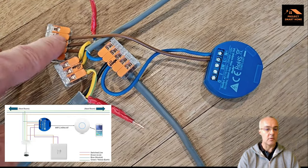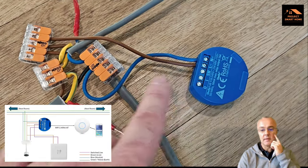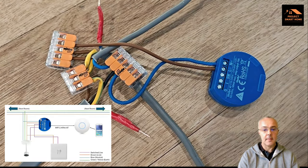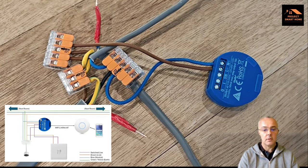As we saw from the wiring diagram earlier, the Shelly needs a permanent live and neutral. I've stripped back some twin and earth cable and taken the brown and blue cable out of it — connected the brown cable into the live WAGO connector block and the blue cable into the neutral connector block. We now have a live and neutral connection for the Shelly itself. The next step is to add the switched live into the SW terminal on the Shelly. The switch live is the cable that is switched from the light switch itself.